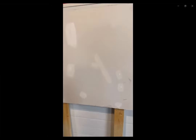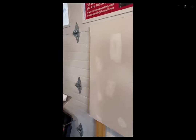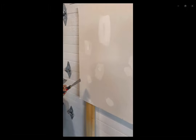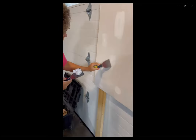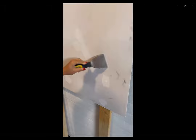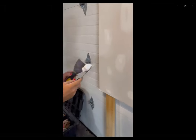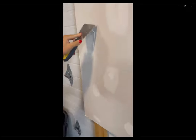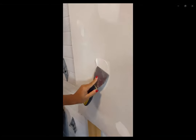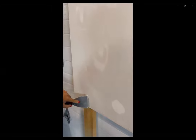Hello everybody, we're back. Right now all the patches have been dried. See how all the dark gray turned kind of white. And with this plaster that we use, that's how you see it. When it's the pink stuff — the Drydex that we mentioned on our list — it would go from pink to white, so it's always a little bit easier for homeowners. So Rafi is going to be putting on the second patch now. She does a little bit of a scrape to make sure there's no little chunks of the plaster anywhere, because it can affect your result. Very lightly. Then she's going to apply it — and she tries to apply the second coat on a bit of an angle, on the opposite way that she did the first one, just because it fills in the gap a little better when you do it the opposite way. And notice how she's doing it nice and thin again.